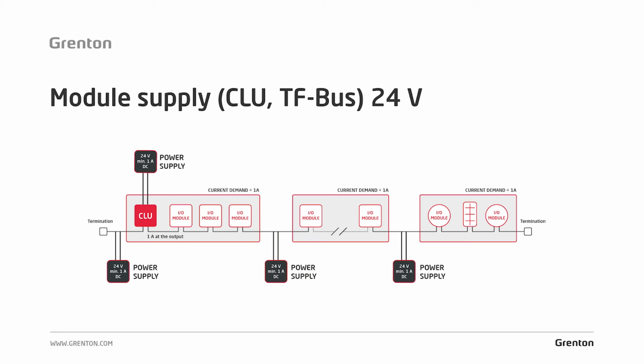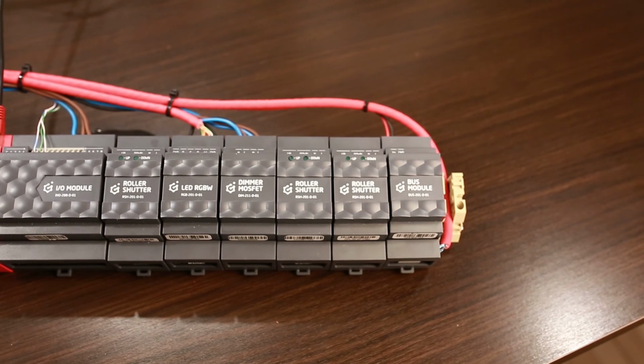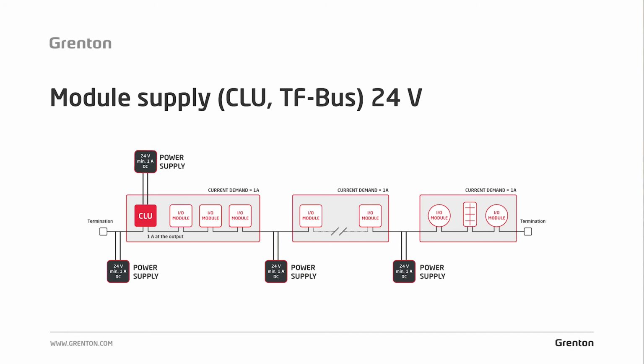By the way, you can see how to connect the bus to the bus module. In the case of the bus module, I will show from the connector side that both the power supply and the bus are connected to the cables which are between the bus connectors. In this case, the power supply is connected to the first 2 left connectors, and in the right 2 there is already communication, which in the next step will be connected to the panels located on the object, and exactly in this way you can make a connection in your own switchboard.